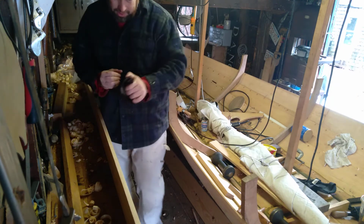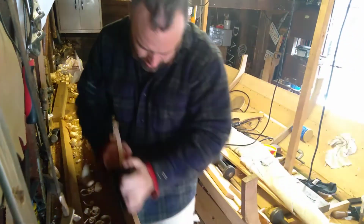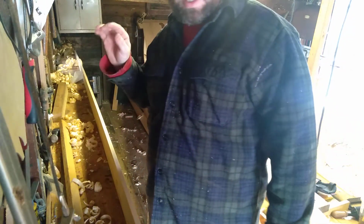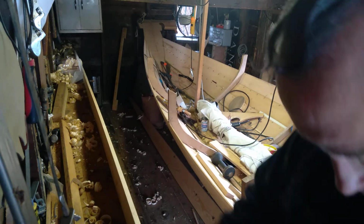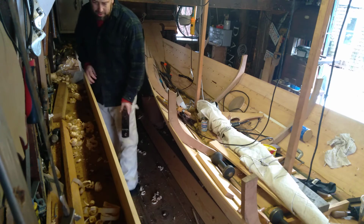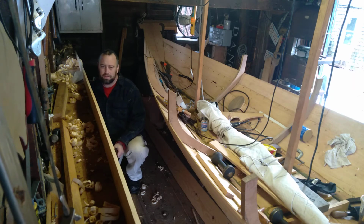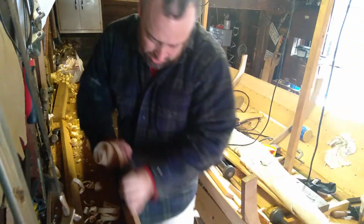So the hook that's drawn in there from along the bottom could well be hook in the next plank. You know, there could be a dive in the next plank up, but we've got an inch and a quarter overlap, and we don't even have gains at the back, so we've got, theoretically, an infinite amount of room back there to play with. So as far as the plank overlaps, we've got a lot of wiggle room in there.